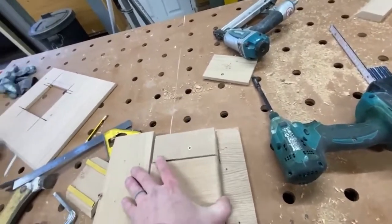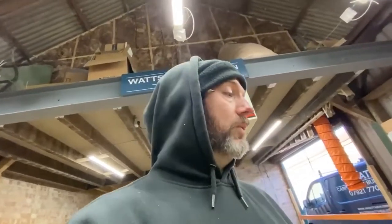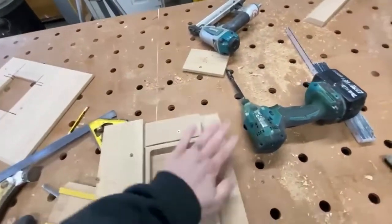And that's purely because anyone that's ever routed the end grain of oak will know how much it explodes if you're not careful. Now, I've got a spindle moulder over there. I've got a router table. I'd always personally favour holding the tool and having the workpiece secure, because if it explodes on you or moves or jumps out of your hand, you can hold that tool better. The Festool router was designed very ergonomically to hold it correctly, and it's sitting in the jig as well. It's not going to do you any damage. But if the oak moves, it's shiny because it's planed, it's going to slide out and smack you in the face.